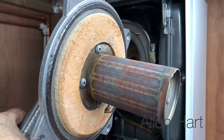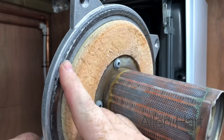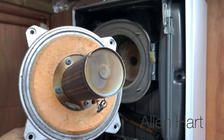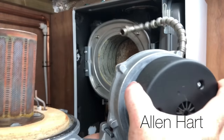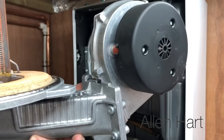That's inside your heat exchanger — so that's the burner. This is the seal I was talking about earlier, just there, so you need to make sure that's been changed. You've got your spark electrodes there and then your fan there, so that all comes out as one unit.